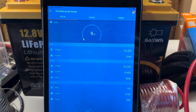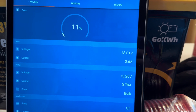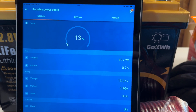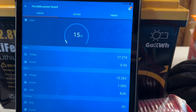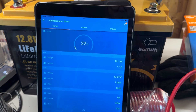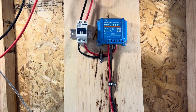As it turns out, it didn't affect it in the slightest bit. I've got a 19-volt, 100-watt solar panel out there. Now it's pretty dark out there with fast-changing conditions and trees blowing in front of the panels a little bit. But a few minutes ago I did have about 87 watts coming in briefly for a sustained time, and everything just looked absolutely fine. I started to mention it last night, but I thought maybe someone is going to point that out — and someone did, which I think is great. And I got a lot of other great comments about various ways to improve upon this little charging board.